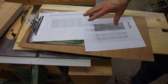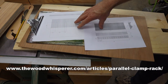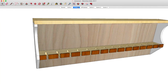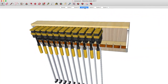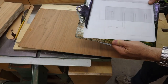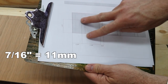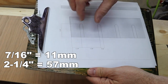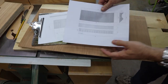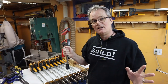I did some research online and I'm mostly planning to copy a plan that Mark Spagnuolo, the Wood Whisperer, put out like eight or more years ago, but I had to modify it for my own needs. I worked it out in SketchUp and printed out the important parts. The key dimension for me is seven-sixteenths inch wide slots, two and a quarter inches deep, spaced two and three-eighths on center. I'm making just one rack for 14 clamps and treating this as an experiment.